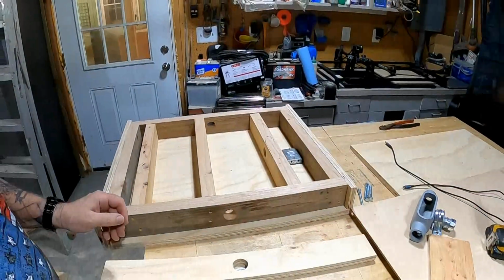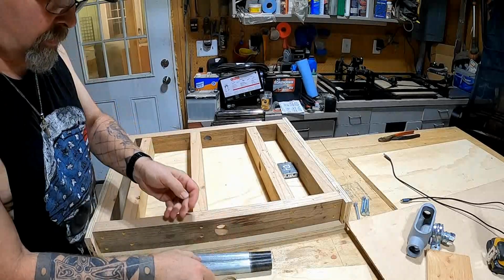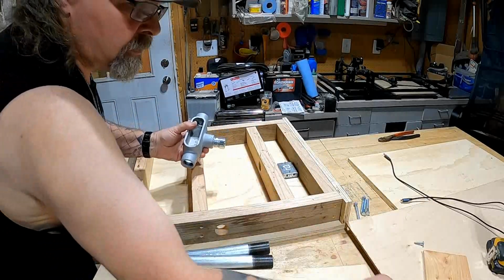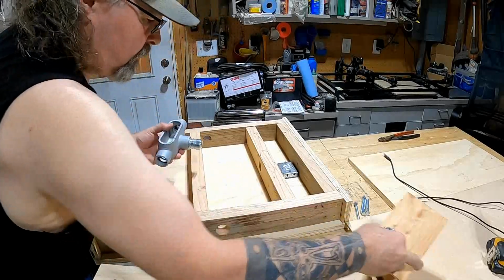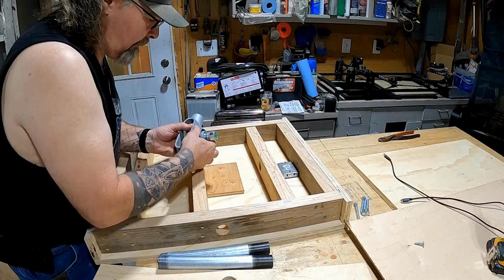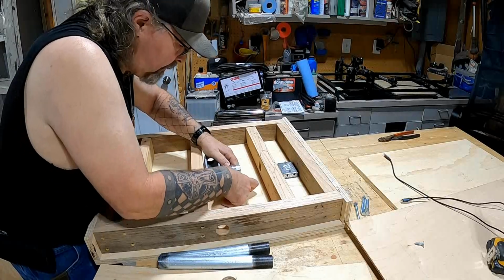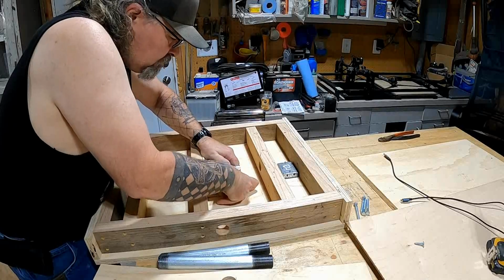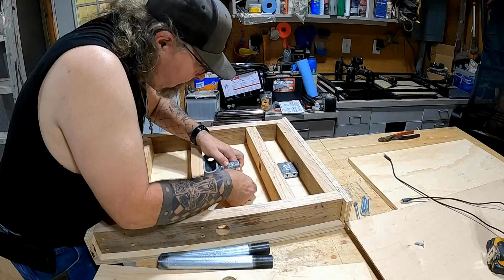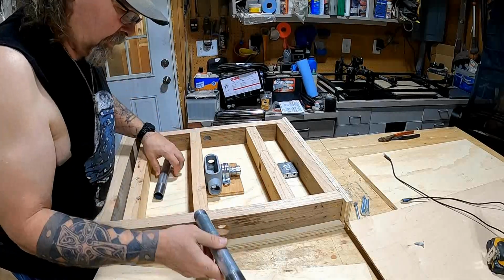So I went with the 1-inch rigid metal conduit. This is what we use in the electrical world for running wires through, and 1 rigid T. And on the end of that, I got a 3/4 to 1-inch reducing bushing and a fitting for the wire to connect to, so it protects the wire from the end of the conduit, so you don't have to worry about it rubbing on your wire and boring through and somebody getting zapped.